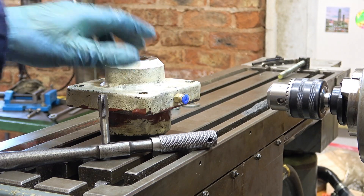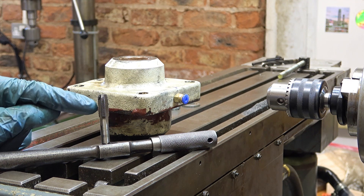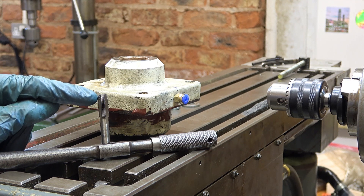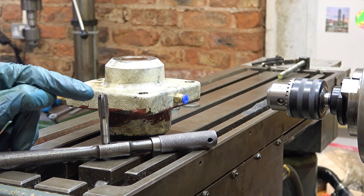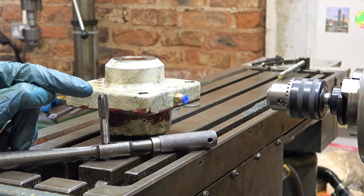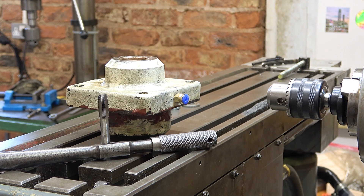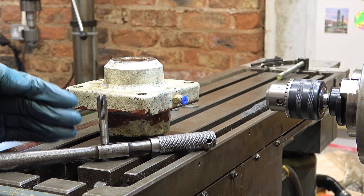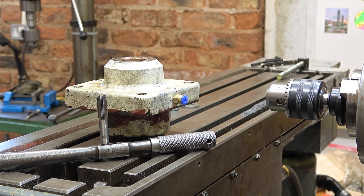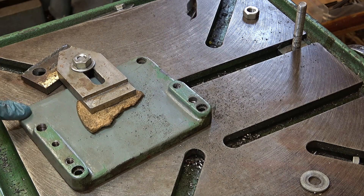The union's fitted — bit of a struggle. This 1/8 BSP tap I got about 40 years ago in a Whitworth set; first time I've used it. It was blunt — the lead on the front was not ground correctly. I've had to do this by hand so it ain't going to be right, but it worked. I've got four more to do. I'll look out for another tap at the auto jumble — less than a pound I would think. It's great when tools are cheap, but not when cheap tools don't work. Quite often these tools all come from the same place and it's hard to find anything quality.